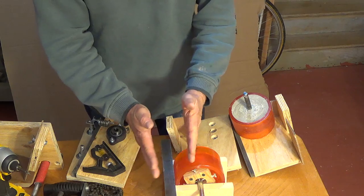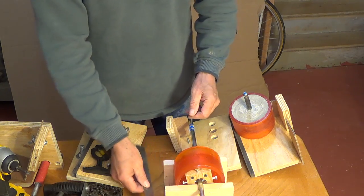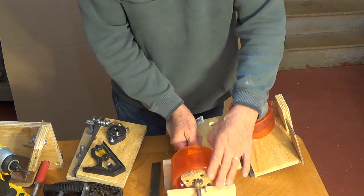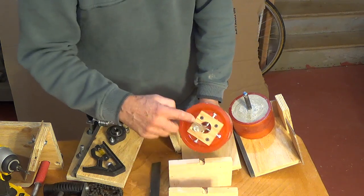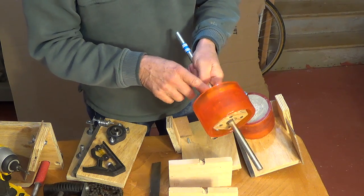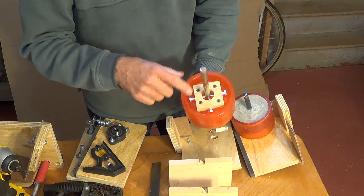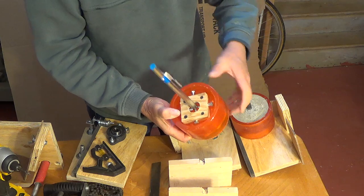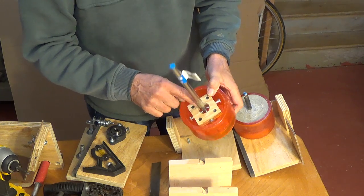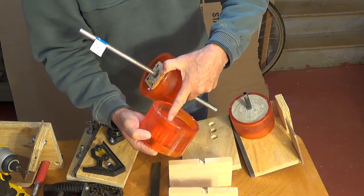Our spring system is going to let this thing move back and forth, so as this goes off a little bit, you just don't want to be in a really bad shape. The first thing you do is get this in here and put these screws on. You actually want to put something in here so that when you put your epoxy it doesn't flow through. You could use a paste epoxy on this side and a flow epoxy here. Remember these all have to be roughened — the shaft has to be roughened, maybe put a flat on it, and the insides of these need to be roughened. Here I actually just went with a saw and cut some notches in it.